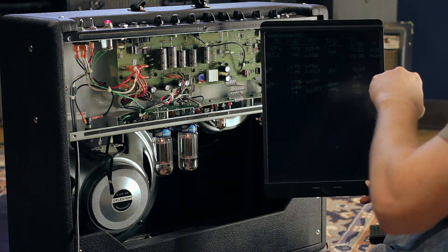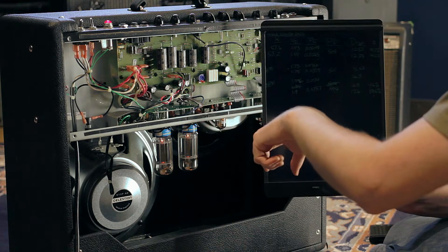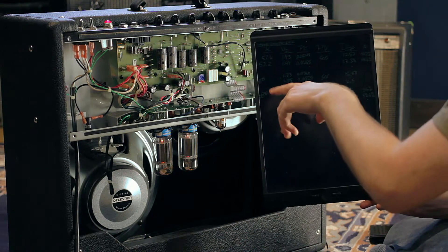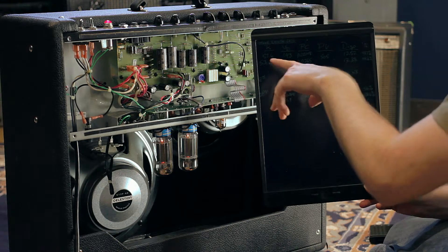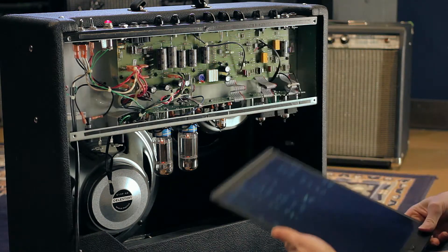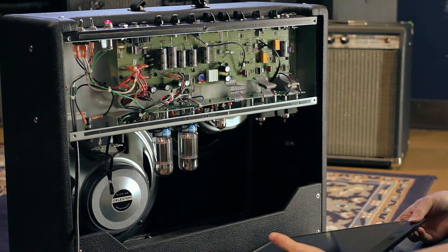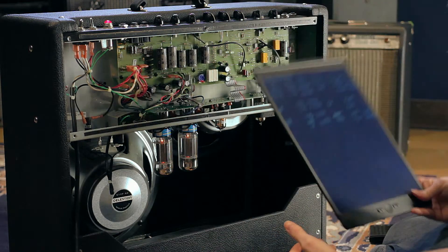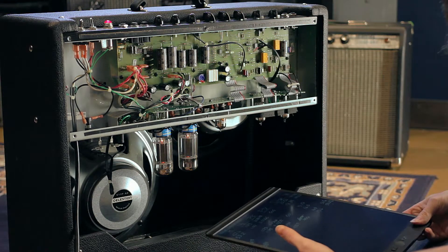That's sort of where I'm going to leave it and try it out. That gives me an idea — I can adjust it up and down a little bit just using the board test point millivolt reading, because I know that between 75 and 81 millivolts, that's going to put me in that 50-some-odd percent range. We'll see if it needs to go higher if it's not sounding right — I may do another calculation or two, but I think that should get me pretty close.